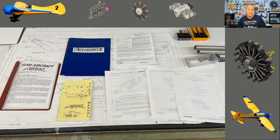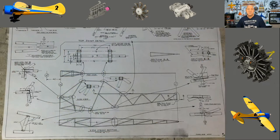In the bottom right corner is the Warp Drive propeller I bought. I'm going to do probably two or three videos just on this propeller because of what I've learned. I don't know why anybody would ever buy a fixed pitch prop for an ultralight, because having a ground-adjustable pitch prop gives you so much leeway. Your exhaust system might not be performing well, you might not be getting the RPMs, and if your engine red lines at 6,800 RPM like mine does, you want to get as close to that power band as possible.